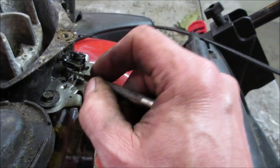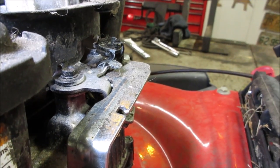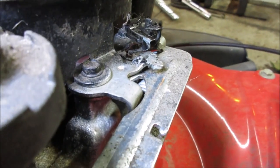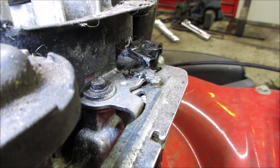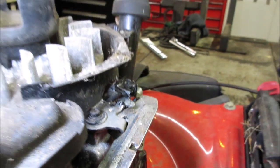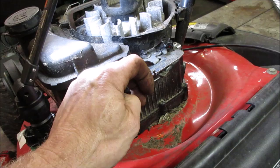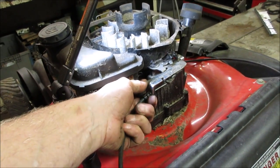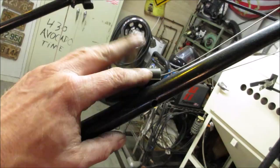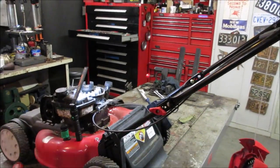Let's go clean that off real quick and take another look. You can see — there's not much room this is making it by. A lot of times cables will just stretch out, or the jacket breaks down and the cable falls in a little further. A good trick is you can pull them back a little bit and put a tie wrap behind them to get that little extra. Generally it's up in this handlebar area that takes the beating, especially if somebody flips the handle down a lot — it kind of beats the cable up a bit.